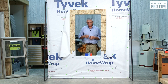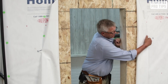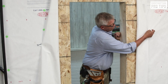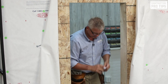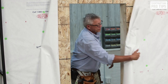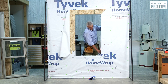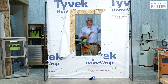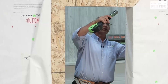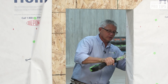Next, in order to keep it in weatherboard fashion, we're going to pull our outside — what we have rolled up here — and bring this in. Pull it in, and we're going to pack this product into place. Wrap it around into where your king stud trimmer studs are, and staple to your trimmer stud.